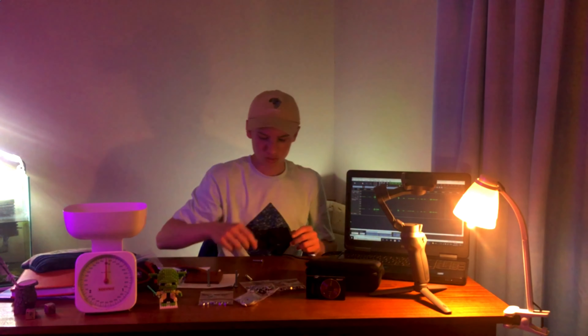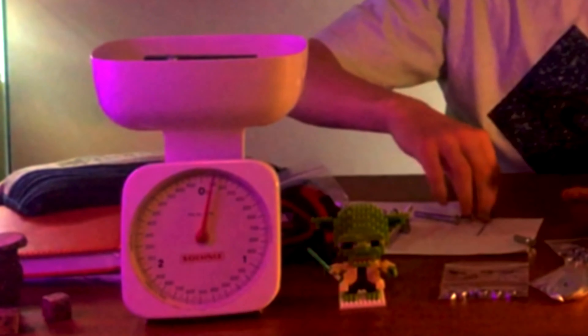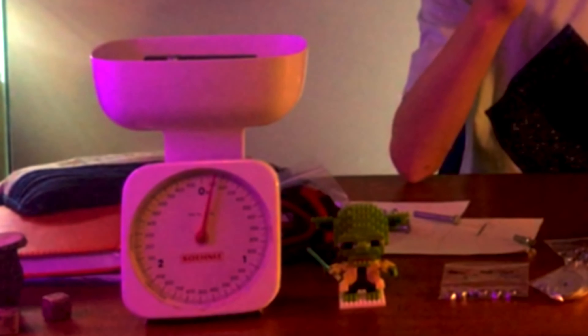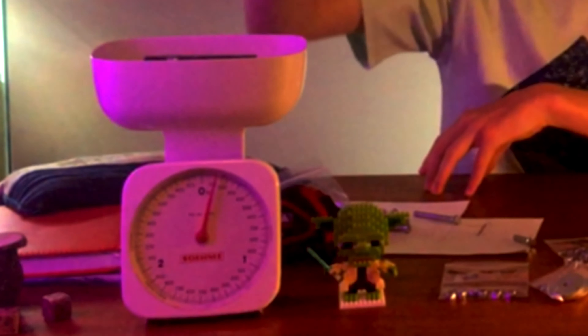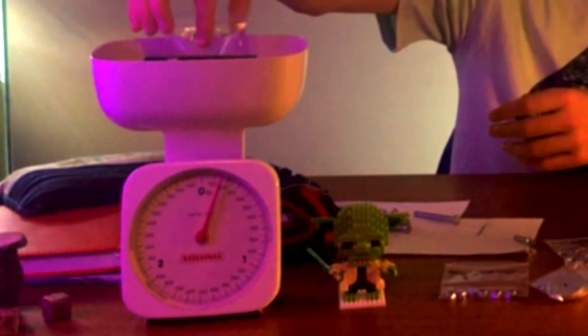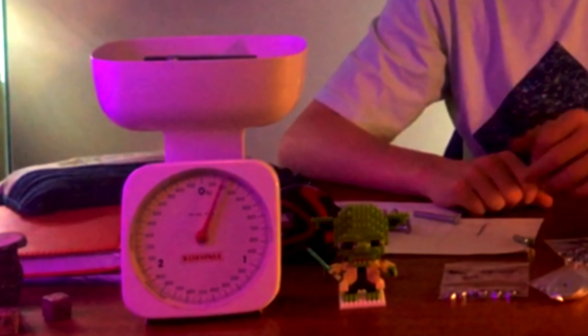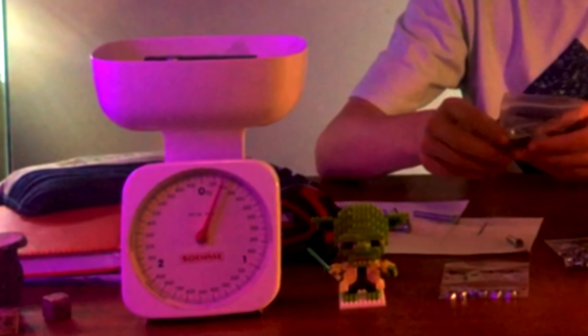The max weight for this gimbal is 270 grams. So we've got a camera weighing around 50 grams, two plates, and then four corner screws and one 6×100mm screw. If I put them all in, you can see it's well under 270, so that will work really well. And then if we need to balance it more, we can use these six washers, which you can just screw on with some wing nuts.